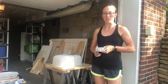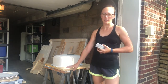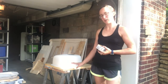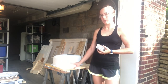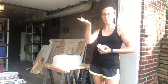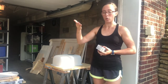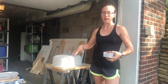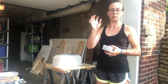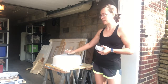I'm here today getting ready to install our undermount sink. We've cut out the hole for both the faucet and the sink on this nice edge-glued pine board — sanded and poly'd with lots of coats. We positioned it in the truck, got it all set up where we wanted it, and I've traced the outline underneath the countertop from inside, tracing the outside and where all of the brackets are, because we need brackets that hold the countertop to the rest of the counter and also brackets that hold the sink in place. I've also traced the lip of the sink.